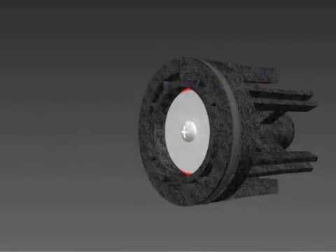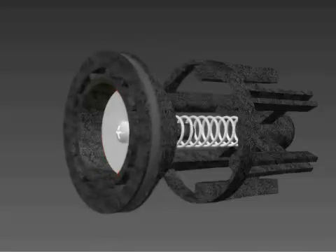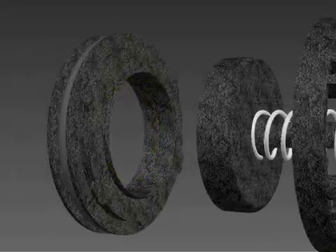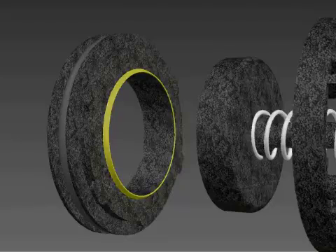CAUTION: The checks are spring loaded. Untwist the seat from the spring retainer in a counterclockwise direction. Inspect the rubber on the poppet for cuts or debris. Next, inspect the sharp edge of the seat with your finger for any damage. If the seat is damaged, replace the entire check assembly.